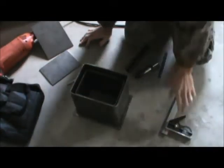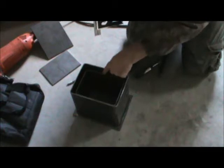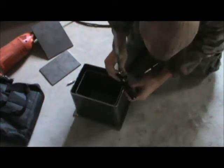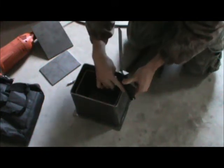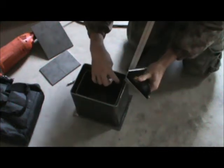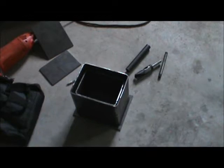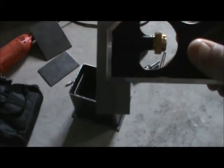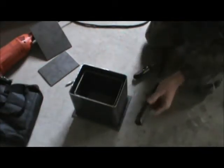I have this depth gauge right here. I need to measure the depth from the top of this surface to the top of the inner piece of tubing right here. When I stick it down there, I'm referencing it at three points — touching the top of this piece and with the rod at the bottom touching two sides of the inner tubing. I get a measurement of just barely under an inch. So I need to measure about a quarter of an inch past that, so I have enough room to weld my piece of one-inch black pipe.